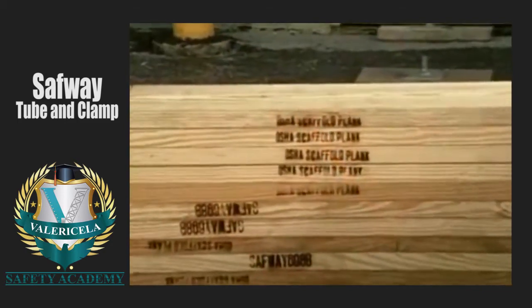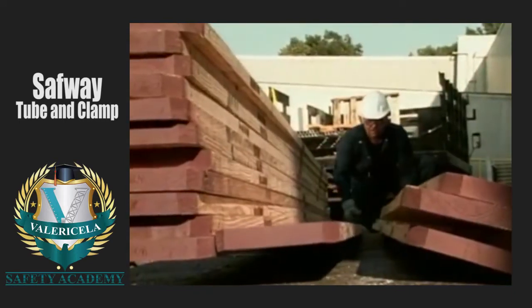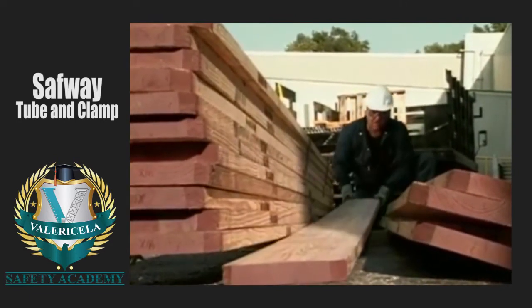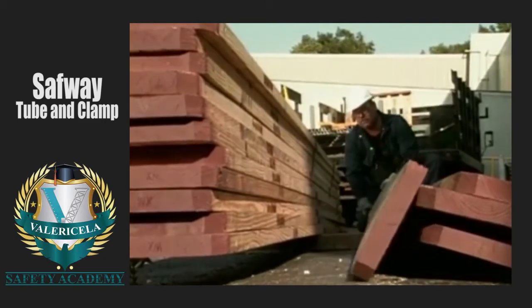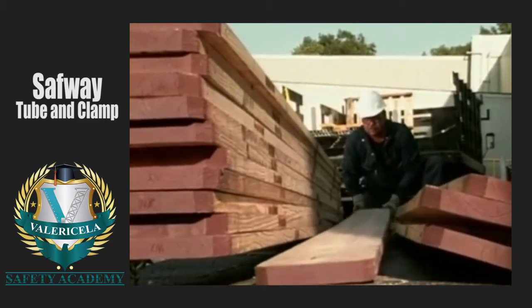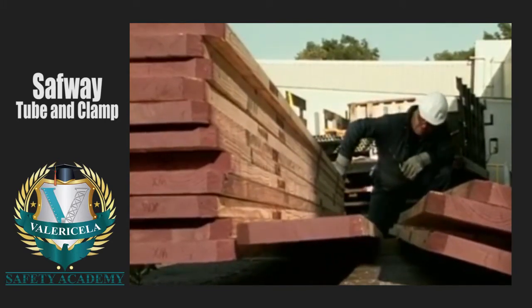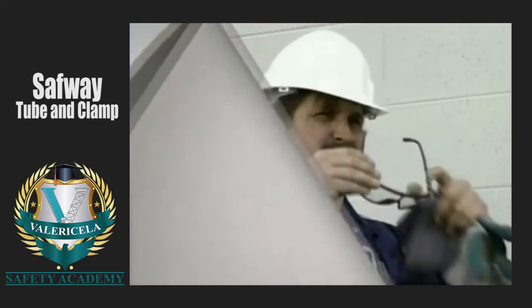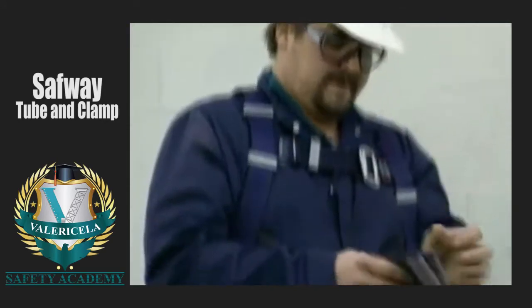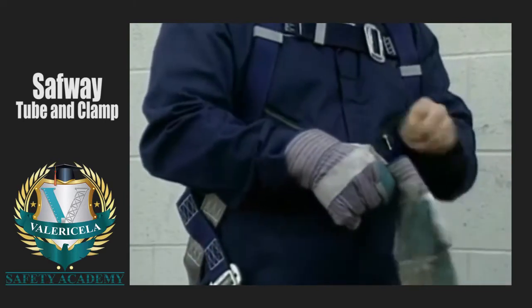Solid sawn lumber used as scaffold platform planking must be graded as scaffold grade plank. Prior to use, inspect each plank carefully and remove any containing defects such as saw cuts, notches, dry rot, splits, discoloration, acid-soaked, or those previously used as sills. The SIA handbook for inspecting solid sawn wood plank can also be used for reference. Finally, make sure that the erectors are wearing the proper personal protective equipment.